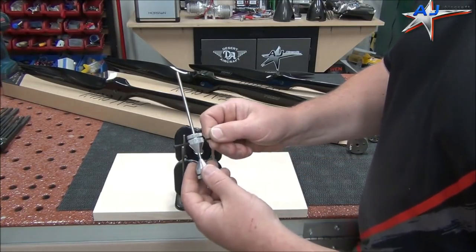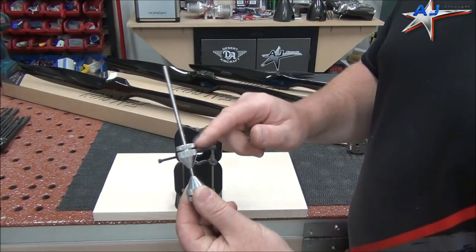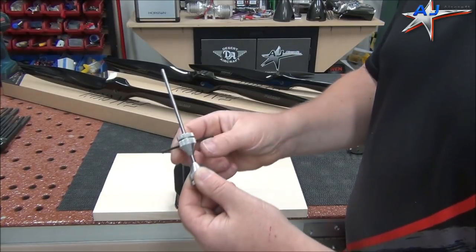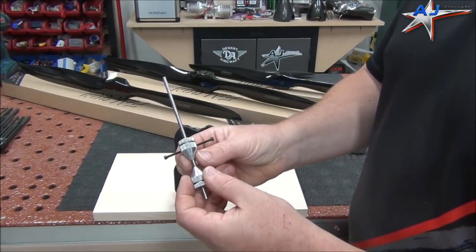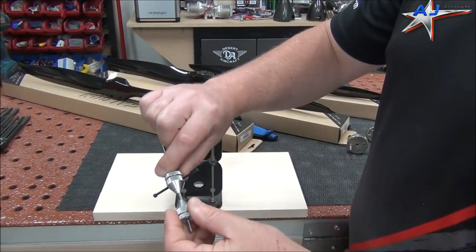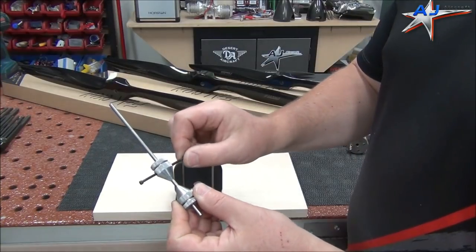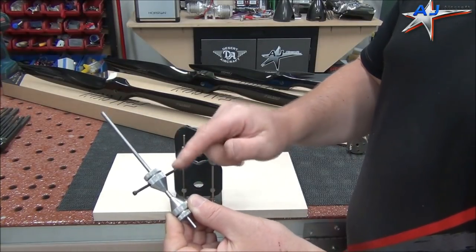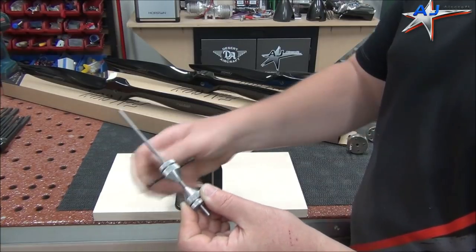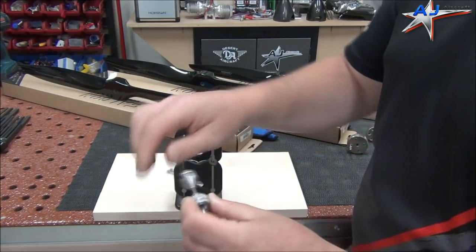Just to clarify because I know somebody will ask right away: I have modified mine slightly because I'll balance spinners, and a lot of times spinners with thin back plates require this to be on backwards in order to get it tight in there. So I've modified this, and to keep it balanced I had to do it twice. I drilled and tapped a hole so that I can actually lock this in place and keep it tight with the spinner in there.